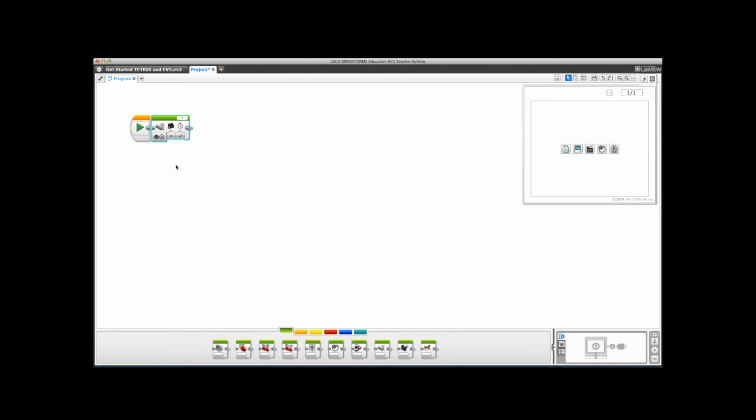And then once you have the box chosen, then you actually have, again, 6 different servos that can be on each box. And for this one, when we're just reading the servo position, then we would wire that value out and take it to another block so that you could actually use that information. Once we have the read position, we also then can basically tell it to move. The servo block actually is a little bit simpler to use in some ways because it's got less features, but again, you can choose your controller box, you can tell which servo that you want it to move, and then you can give it a position.